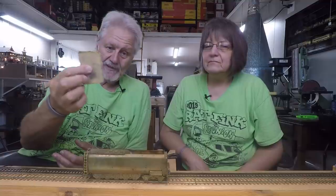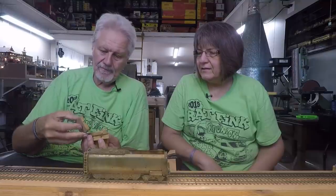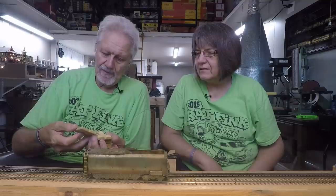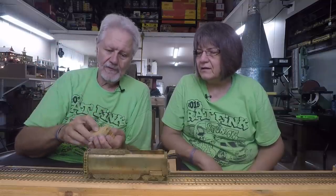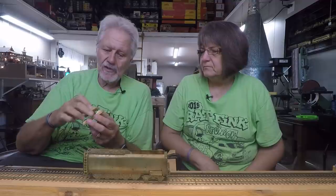The brass castings are made by a machinist capable of doing incredibly small work, and then those are pressed into rubber molds. Some of these molds make locomotive bits and pieces — that's a coupler pocket. Once you have your wax mold, it's put into a wax injector and molten wax is shot into it. When you open it, you now have wax pieces. Those are put into a hard plaster-like investment material called Cristobalite. It's the exact same process used in jewelry making — this process has been around forever for jewelry making and was sort of usurped by the brass engine people.